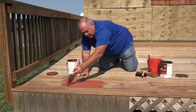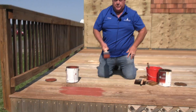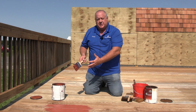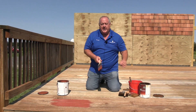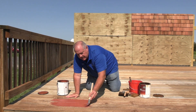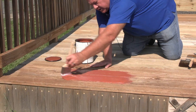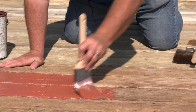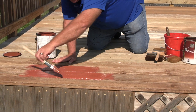One of the rules of thumb when using brushes for sealing and staining a deck — to prevent lap marks — is to always keep a wet edge. It matters less with solids, but with sealers and semi-transparents you always keep a wet edge, working across the deck. With a paintbrush, it's a lot of product on the brush as you go.